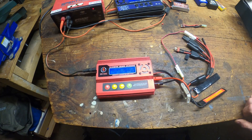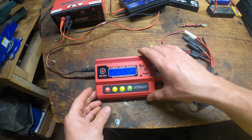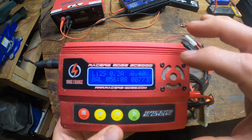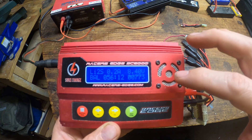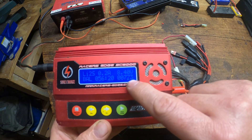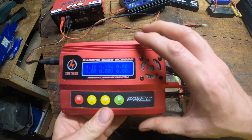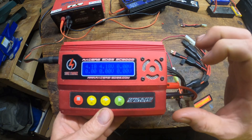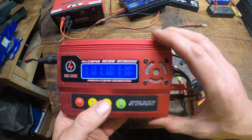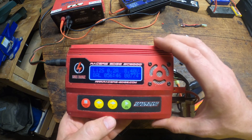We're back and it's been almost an hour — 56 minutes. We're down to 0.2 amps, at 8.4 volts, and we're at 773 milliamps — almost 800, which is absolutely perfect. Let's check our voltages: 4.18, 4.18, 4.18 — perfectly balanced. I said I'd like to see 4.19 or 4.20, so we're very close. The battery is not swelling up and not getting warm.